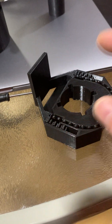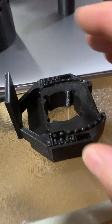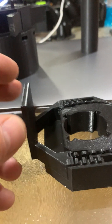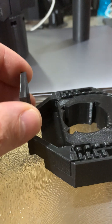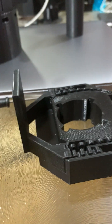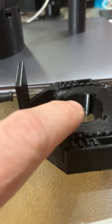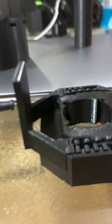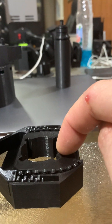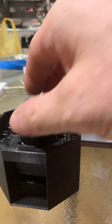In the next one I'm going to play around with some of the gear ratios. The rocking I was talking about before that prevents smooth operation is a rocking in this direction — this edge gets caught because there are too many degrees of freedom. The tolerance between when this piece sits on top and the sandwich piece is very hard to control, so in the next version I've actually combined this bottom piece with the next sandwich piece.